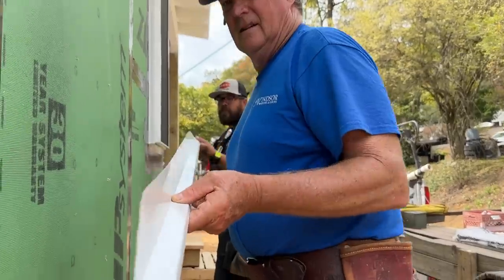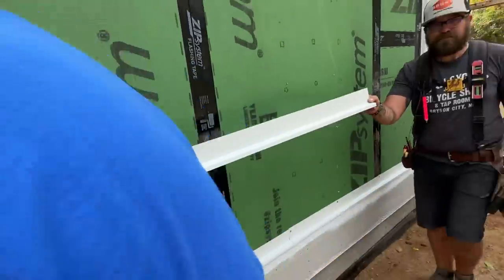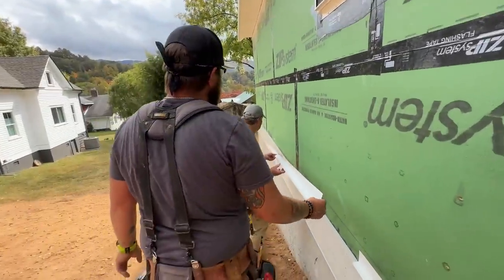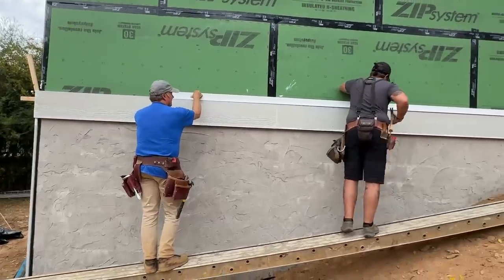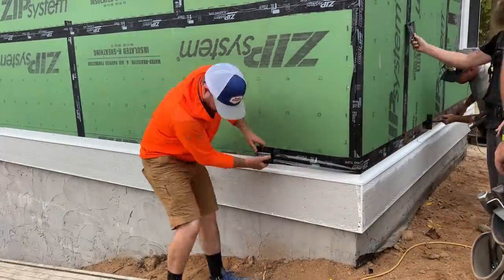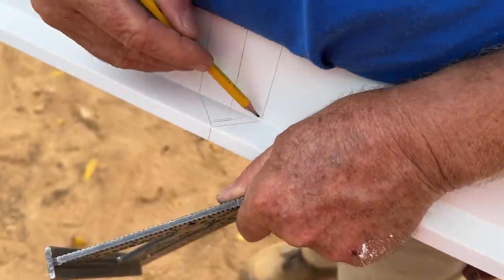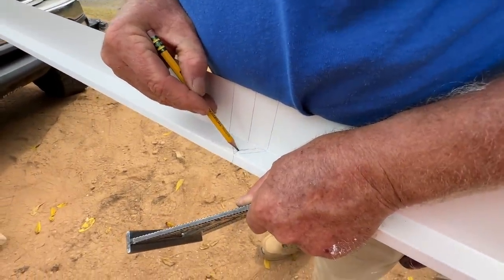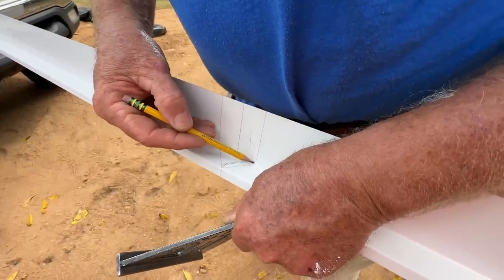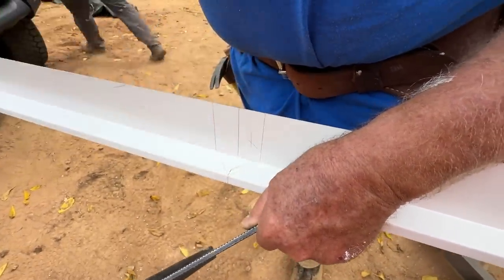All that was a pro tip — and look at that, now you've got a little slope on it. They don't teach you that in flashing school. I'm going to attempt to cut it like this, leave that little flap, bend it down, then cut this piece out. When I fold that around the corner, this will lay on top of that and this little fin will wrap around the corner on that. Holy crap — all right, demonstrate.